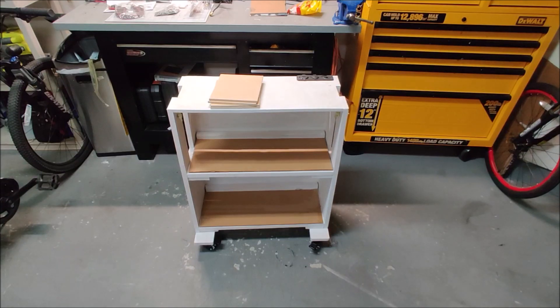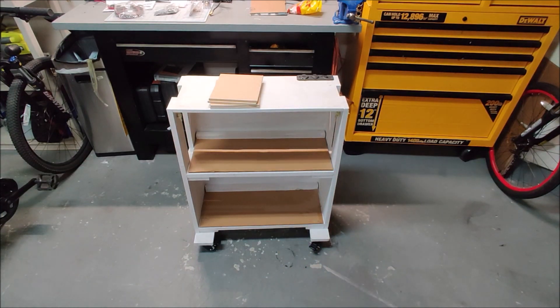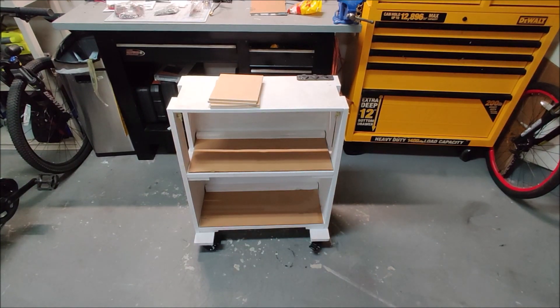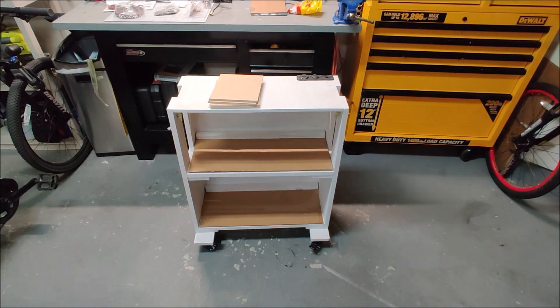This here is the rack that I have built for the lithium phosphate batteries. I'm going to use 16 batteries in an 8s2p configuration — eight batteries across the bottom and eight on the second row. It's important to plan, especially with lithium phosphate, because these batteries are heavy — 180 pounds total. You can't mount lithium phosphate on your wall or a cheap shelf.